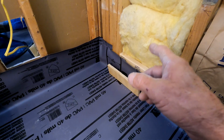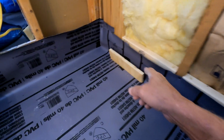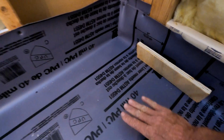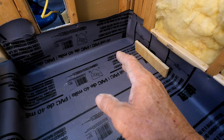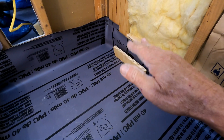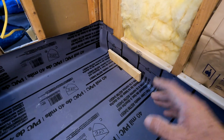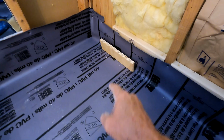Now, the only bad thing about using wood, if you use a screed board to come off of this the way I explained all the way around, is that in about an hour and a half, 2 hours or so, you have to come back and pull the boards out. You have to leave enough time for that mortar to set up a little bit, pull all those boards out, and then fill in the gap all the way around and make it monolithic mortar, rather than leaving the boards in there. Even with the foam boards, I don't recommend doing foam boards.